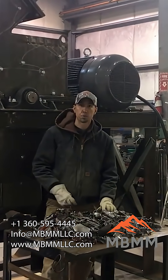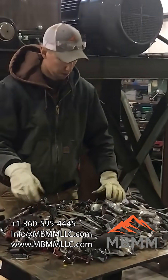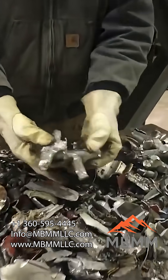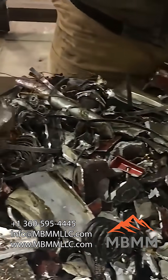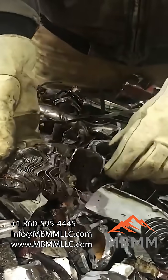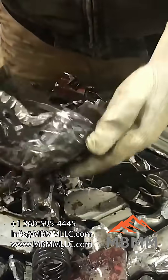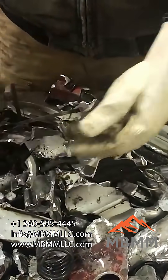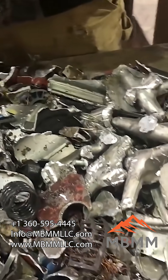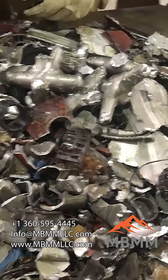Here's our cast aluminum through our bigger hammer mill, and this is with a 4-inch square hole. You can see it broke up the cast aluminum off that motorcycle wheel, the springs and stuff — there was stuff out of the chainsaw housing you can see here. There's that little electric motor that came out of that sander that we liberated. There's that piece of steel off that car part, but we liberated a whole bunch of clean aluminum now that can be sorted, picked, and we've upgraded the value quite a bit.